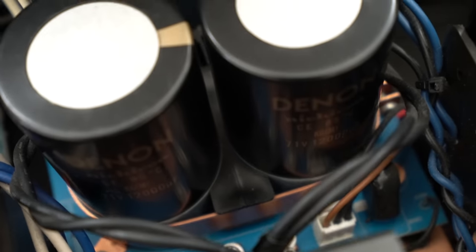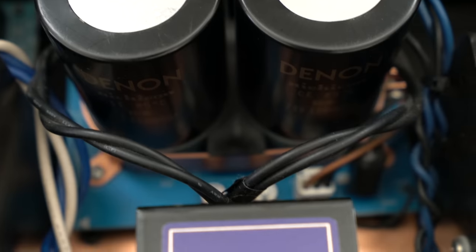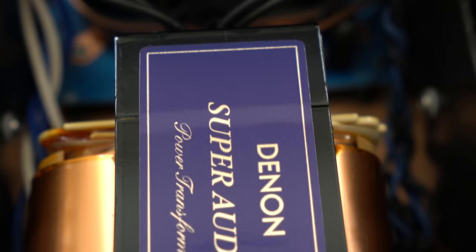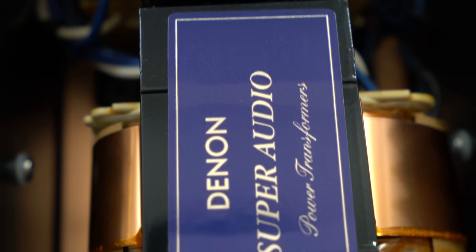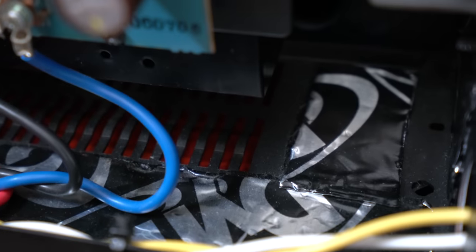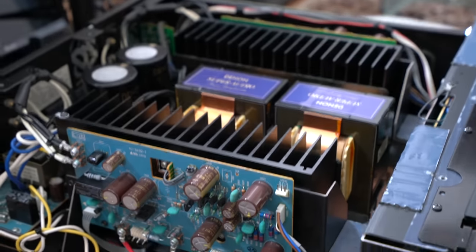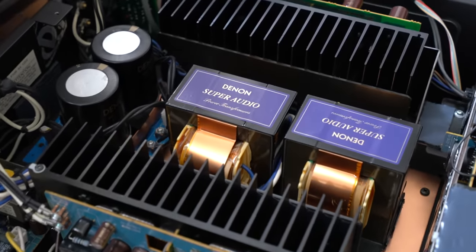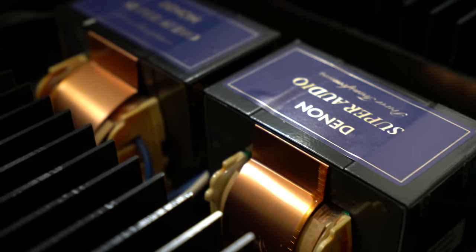As you can see, there's a copper holder for the custom capacitors. The capacitors and two transformers are mounted on an elevated center rail, with a copper metal sheet underneath — that definitely helps lower the noise floor. I applied Dynamat all over the bottom of the amplifier chassis, except for the venting mesh area. I also applied it on the top cover. There's a gray factory Dynamat-type material visible on the front wall — this amplifier is well-damped.